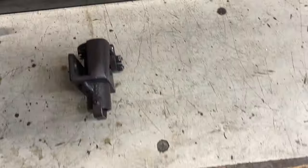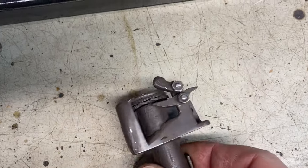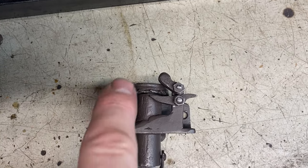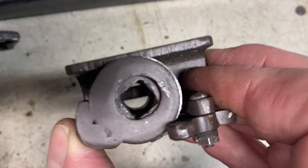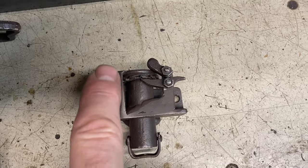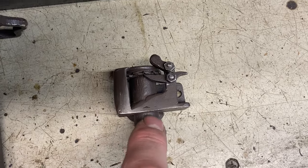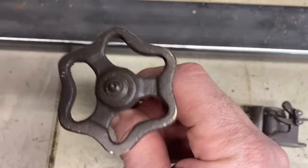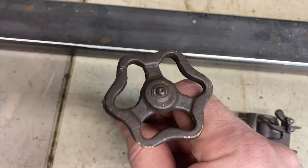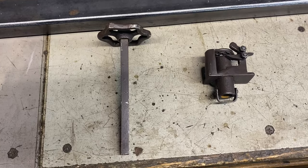Our first step is going to be the frame. You can see it's just a simple piece of L angle steel, and then we've got kind of a bracket here that's been sculpted with my flapper wheel that holds an upper shelf, which is just a big washer, so that's simple enough to make. Then we'll weld that shape up and cut a tube in here that fits. These are two sections of tubing just blob welded on to the inside. The brake wheel itself is not too difficult - just a piece of square stock and an old water faucet handle, so I'll have to dig through the plumbing drawer.